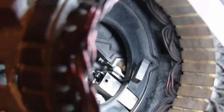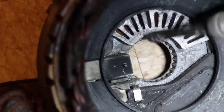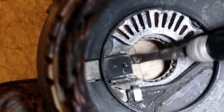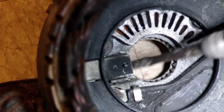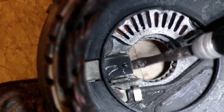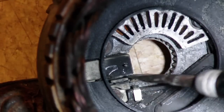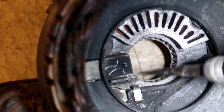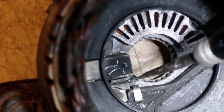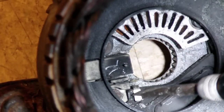Now I'm going to insert the other spring and put the next brush in. Inside this alternator, the brush on the bottom is grounded — it just goes to the chassis, so that's the negative brush. This brush on the top is the one that's hooked to the regulator. What I've done is disconnected the regulator from this brush — there was a little blade plug right here where this brush attached and plugged in — and I've opened up these little blades and disconnected it from this plug.